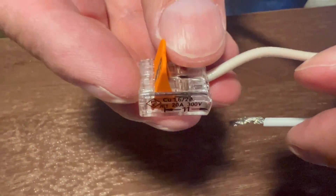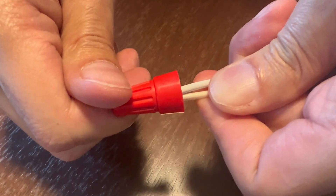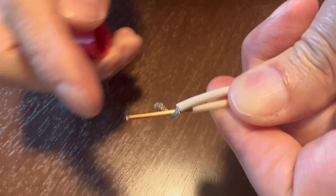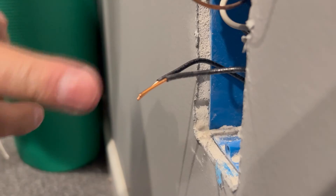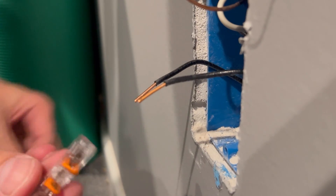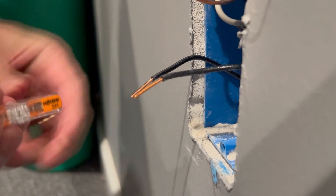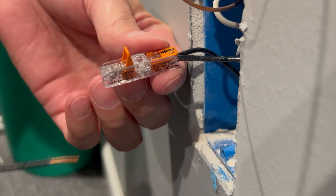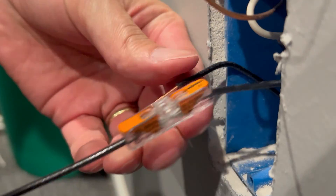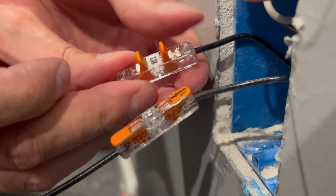You can also mix and match different types of wiring and sizes. When securing a stranded wire to a solid wire with old wire nuts, it's often an unsecure connection. For cases where the wires have been cut too short, WAGO also makes these straight connectors so you can increase the length of your wire. They really are so easy to use — as long as you have the right amount of insulation stripped back and the wire exposed, it will securely hold it well.